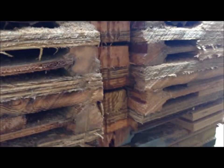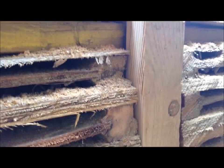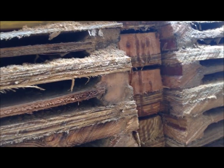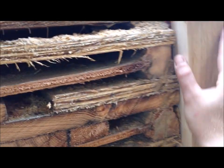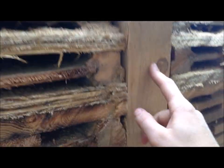So I cut kerfing this back side until I notch it out with the chisel, and then I cleaned it up with my saw, and I cut a piece of 2x6 so it fits in there just about perfect. So now I can attach this with some lags, especially these three 2x4s if I get it through there because those go all the way through the front, and then this will be super solid, and I could run pieces off of this to my 4x4.